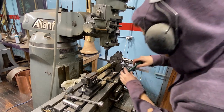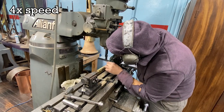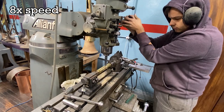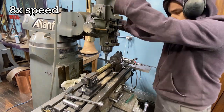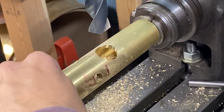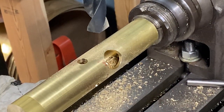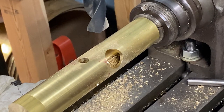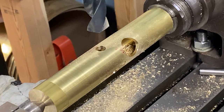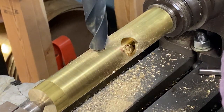We're going to get a little stone. It's a brand new drill bit — I find it's important to brass it off on the inside of the flute. That went great — I was not expecting it to cut that nice. So we're going to go back — 1.015. We're on the right index, sitting at 68. So 68 is our number. There's 100, 200, 300... 1 inch. And then we go 15 thousandths — 15. Check out where our tip sits. Looks good to me.